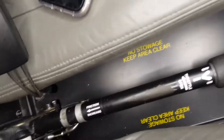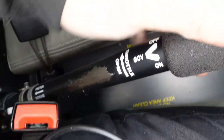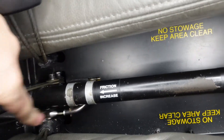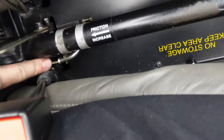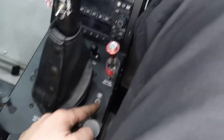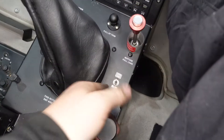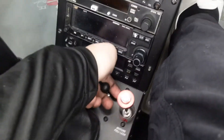The collective also has friction — this white knob. If I pull that up the collective is really easy to move up and down; if I put it back, collective friction is on and it becomes very heavy, though you can still move it. We have a device called a collective pulldown device in this helicopter. If we have an engine failure it will pull the collective down very quickly by itself — a cool feature. Not very many helicopters have them.